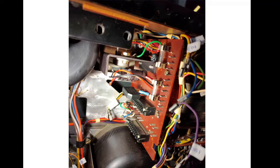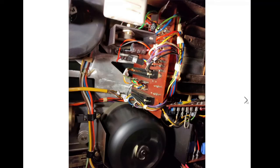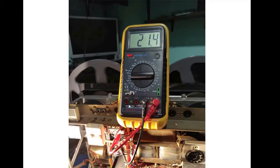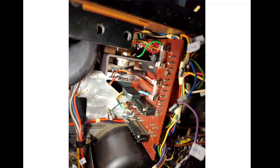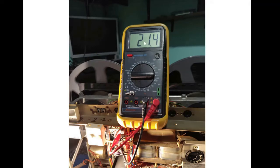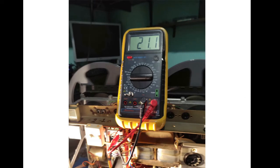This is the board back in place. These are the three screws — the other screw that was at the back I didn't put back, and that's okay. Here I plugged in again all the cables. Here I test the 21 volts to see if it's okay — it is okay. I could use the trimmer potentiometer on the board to adjust the voltage to exactly 21 volts, but it's not very important. When I turned on the machine this voltage dropped to 21.1 volts which is fine.